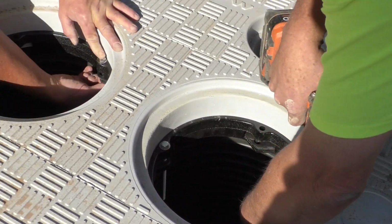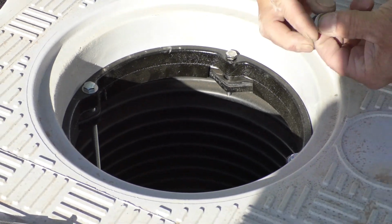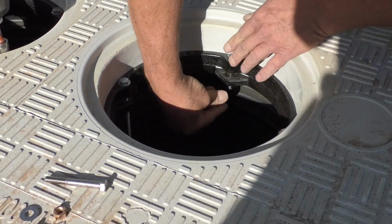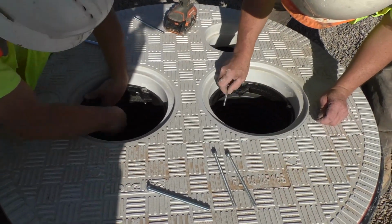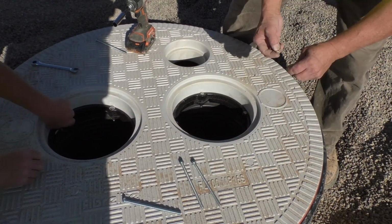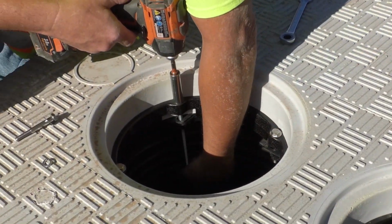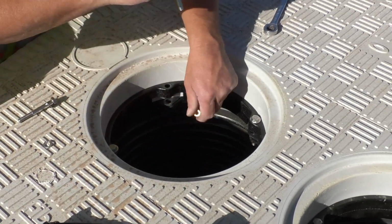To properly connect the spill buckets, position the holes on the top edge of the spill buckets and shrouds within the port openings and drop the black cast iron clamping rings into place above the spill buckets. Using the 4-inch carriage bolts and nuts that come with the clamping ring kits, bolt the spill buckets to the clamping rings installed in the port openings.